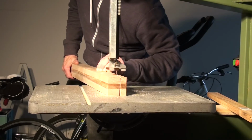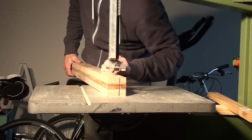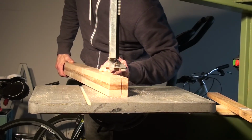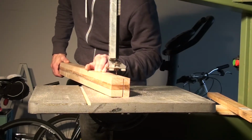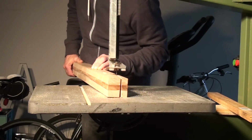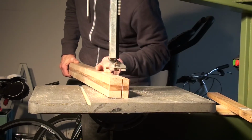It's been damaged at some stage, and so it's very hard to keep the timber flat because it depends on which side of that line the timber is resting on. You can see now it's starting to lift off on one side, so that caused the cut to come out uneven, and the cut was very rough because of that lump on the wheel. Anyway, I guess we'll go back to normal audio now.